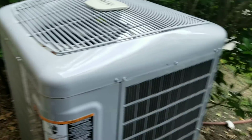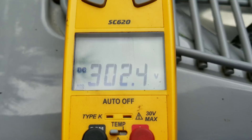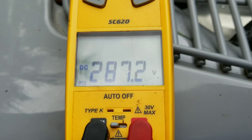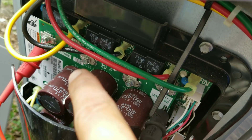Our unit is powered down — you can tell our fan is spooling down now. You can see our DC voltage is still way up there. So if you were to shut this power down and stick your hands in here, maybe pull the leads off to ohm out a compressor or anything, if you touch any of those terminals in there, that will light your world up.